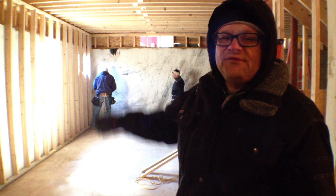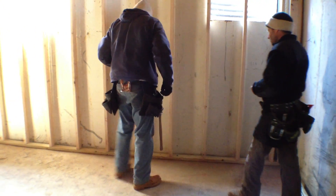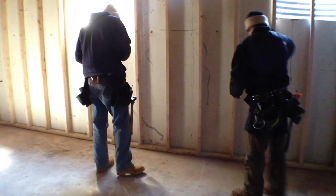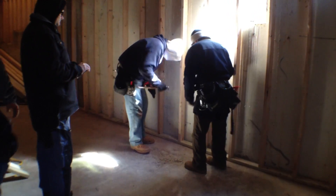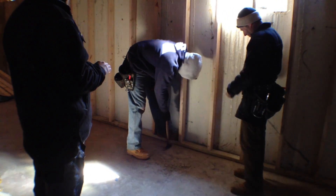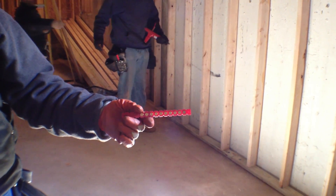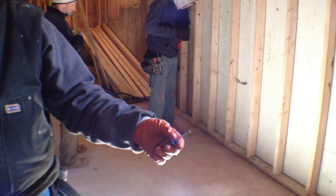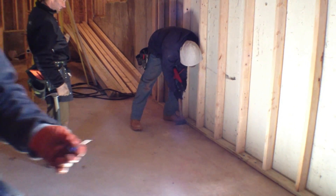We're on a job site today with Tony. We're using a bunch of Hilti tools — wall tools, all kinds. Now we're in the basement of this project and they're about to shoot the floors with the Hilti stuff. We're going right now securing the treated sill plate to the concrete floor. Always take the first shot with safety glasses. Standard Hilti red shot for cured concrete, using the two-and-a-half inch treated lumber approved nail with the washer so you don't blow through it.